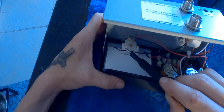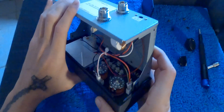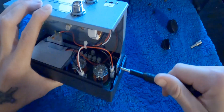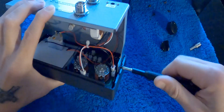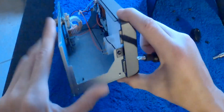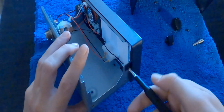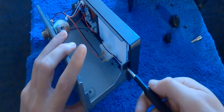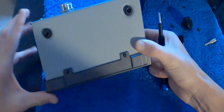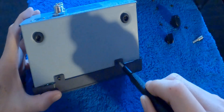This ground right here wasn't soldered together when I got it, so I had to solder that. What you're going to do is take off the one screw on both sides. These were not Loctite, but they were on pretty tight. Just set them aside, take this other one off. Then to actually take the faceplate off, you're going to have screws on the bottom that you'll need to take off — these two right here. You're going to leave the other two, because those just hold on the feet.